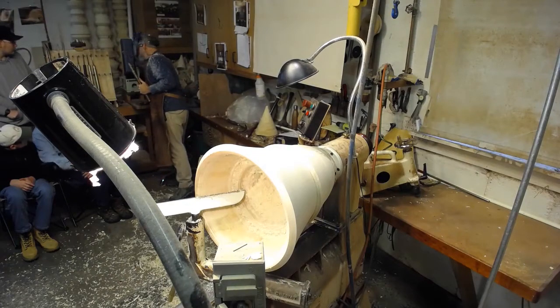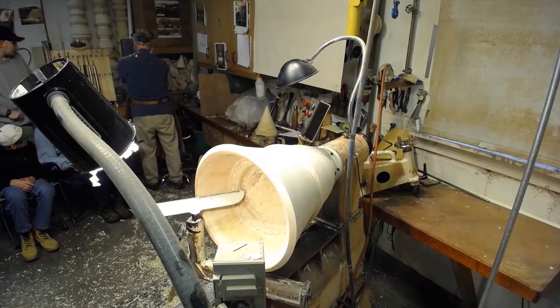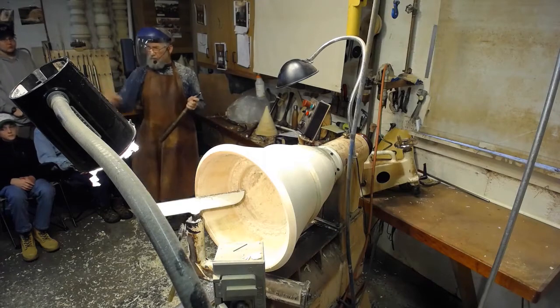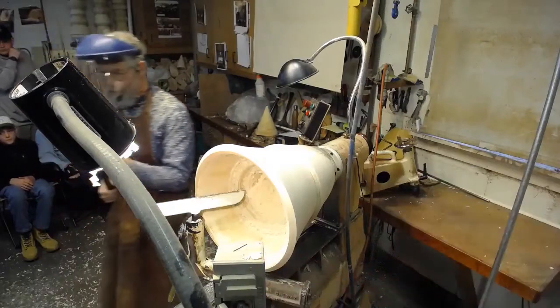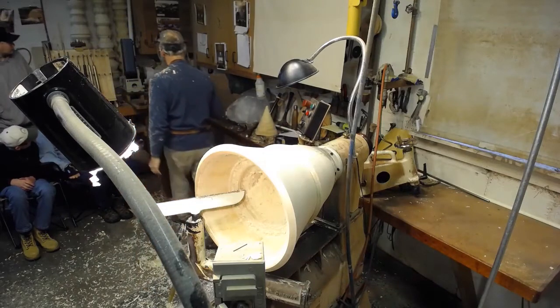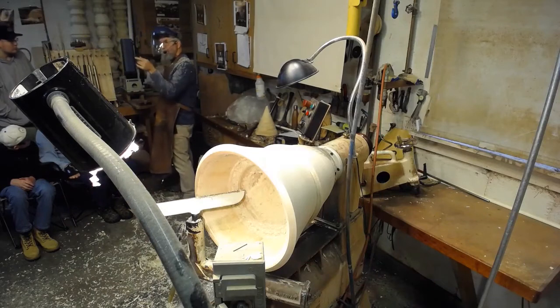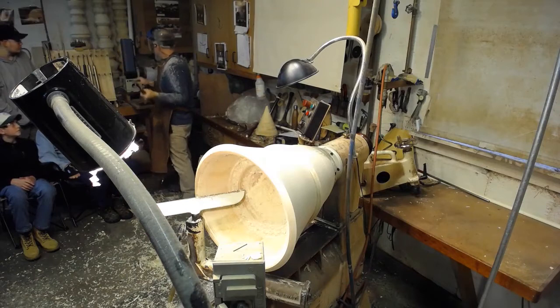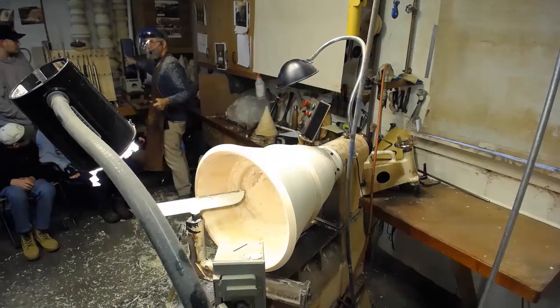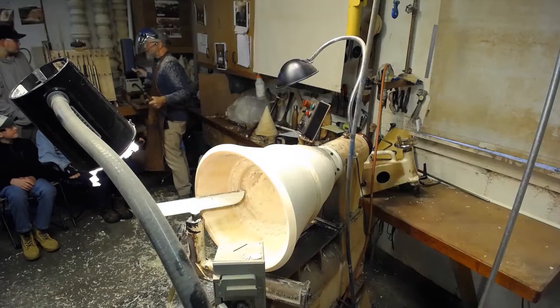So my entire sharpening process takes this long. And usually that's set up right where Peter's sitting, so it's just right there. I can quickly get this right to super sharp. No, it's a hard felt wheel that I've gouged out to make something that I can turn the gouge upside down and do the outside. I've also purposely dulled the left side of the belt. I just use my teardrop stone to dull the left side of the belt, so I'm grinding over here and almost buffing, or buffing is not quite the right word, but polish. Yeah.